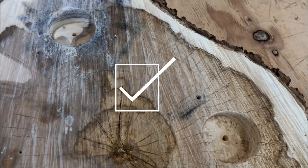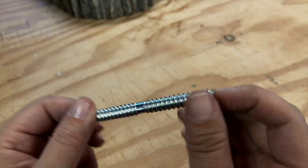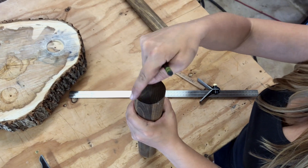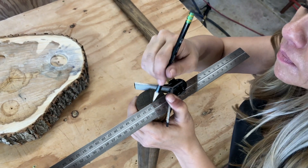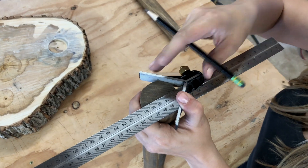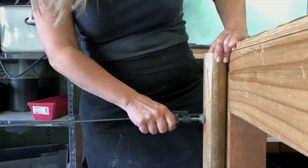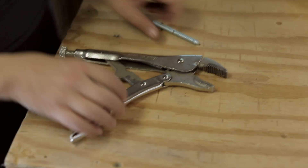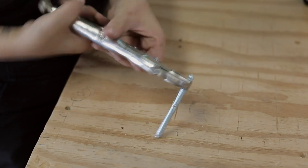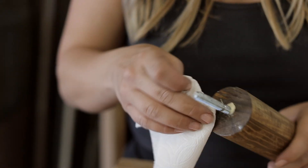I pre-drilled down about an inch and a half so I could screw in the legs with three-and-a-half-inch dowel screws. It's super important to find the center of the leg to insert the screw so the legs go in straight. This tool is called a center head — it's used for finding the center point accurately and easily. You line it up, mark the first line, turn the leg a quarter turn, mark the second line, and boom, you have your center point. I attached each leg to my workbench using a clamp and a level, then used vice grips to hold the dowel screw, added wood glue down the pre-drilled hole, and screwed it in until it stopped. I cleaned up the glue spillage with paper towel — table leg!